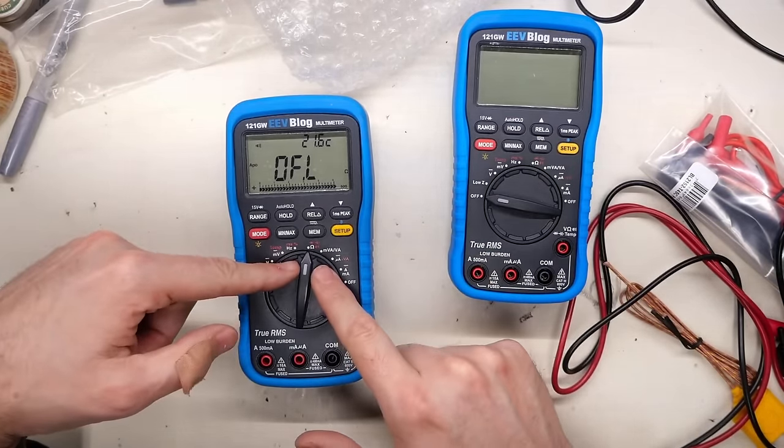Well, one thing I'm noticing is I think this one's acting up. Did you notice how low the resistance value was? Typical with the probes is gonna be like 0.2, 0.3, and it was like 0.0 whatever. That seemed too low. And now it's kind of going all over the place. Let's clip these together. I've gone ahead and clipped the probes together, that way I'm not touching it. I mean, maybe they just are really low resistance.